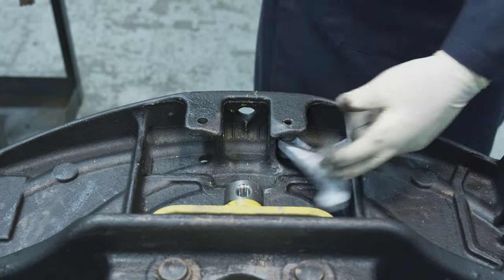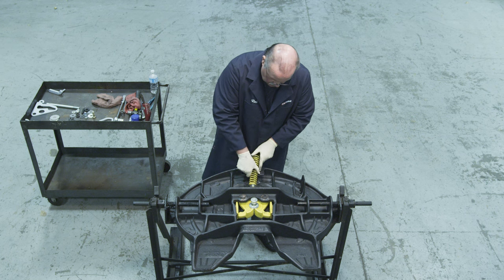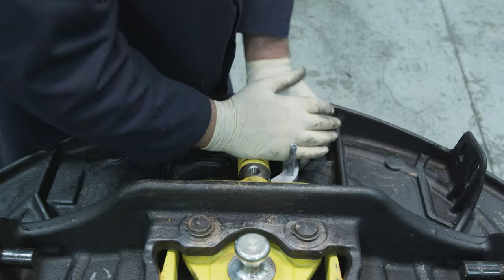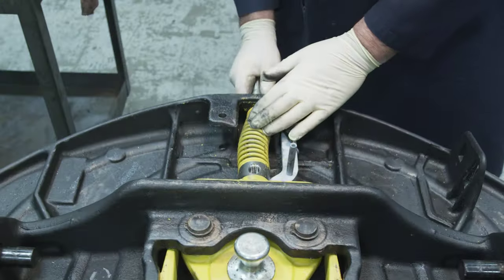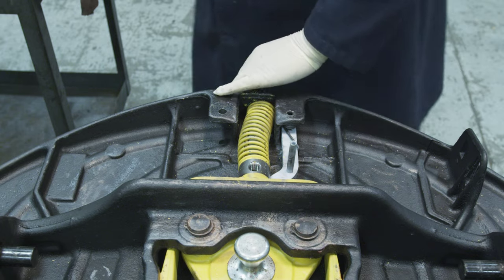Check the lock spring for tension and the lock for free movement. Next, install the yoke spring. Once the spring is in place, slide the yoke shaft into the casting, through the spring and into the yoke. Align the recessed hole in the shaft with the threaded hole in the yoke.